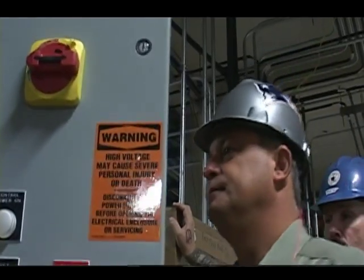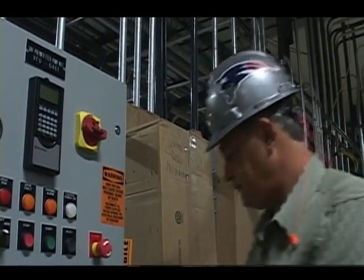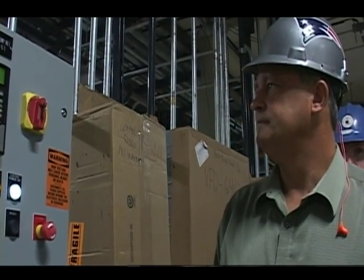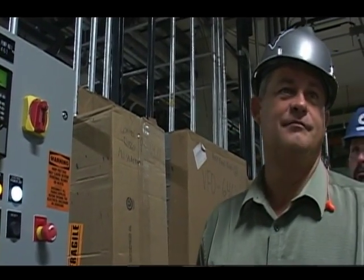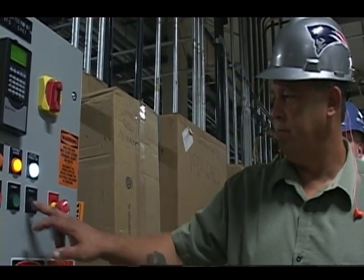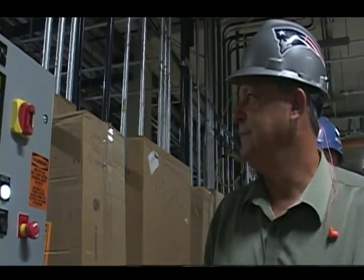Okay, switch lock. Okay, apply power. Okay, showing the thermal alarm. Control power is on. Okay, we're showing a thermal alarm. Not sure why. The motor may not have one, it may not be wired, or it may actually have an alarm. My guess is that it's probably not wired. Something to be resolved at some point. Okay.